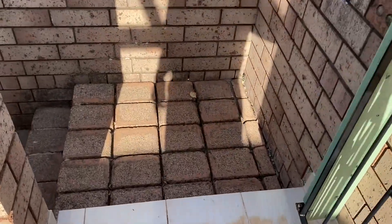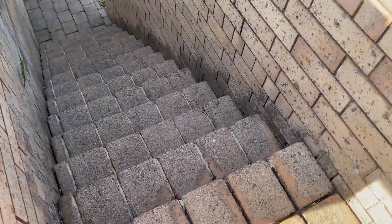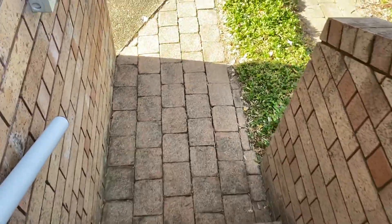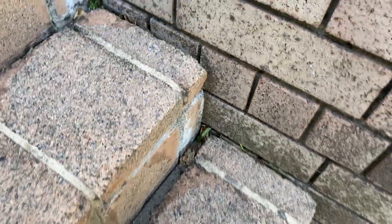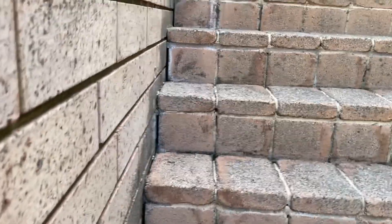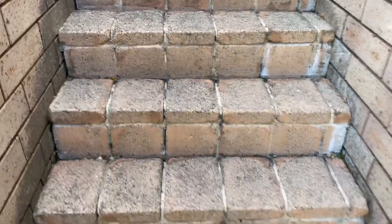The stairs are pavers and water saturates the concrete slab under the pavers and leaks into the stairwell below. There's most likely no waterproof membrane under these pavers. There's a large gap at the back of the pavers — I'd recommend that gets filled with a waterproof grout with a little colour-matched oxide. That would stop the amount of water absorption into the concrete slab, and these pavers could be spot repointed. Polyurethane joints down the side and seal with a clear masonry sealer — it won't stop all the water, but it would be highly beneficial.